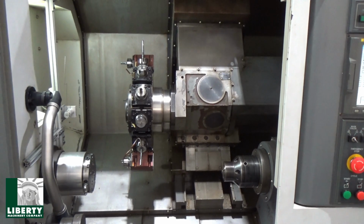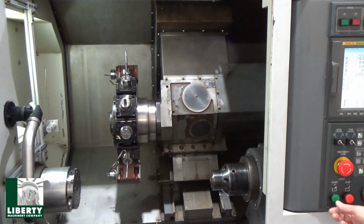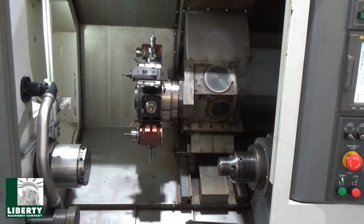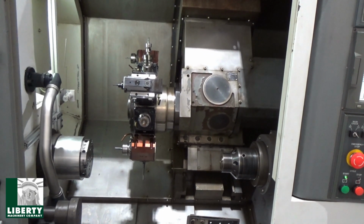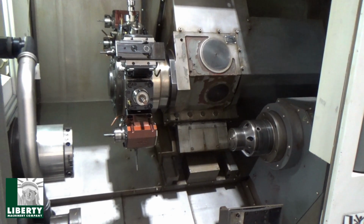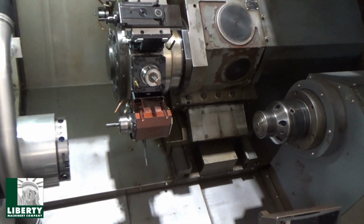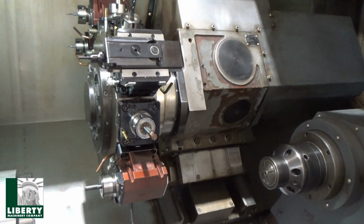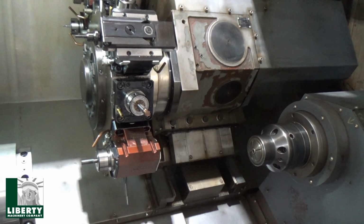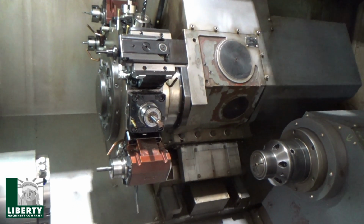And we're at full speed. We can be because we're cutting air. Spindle doesn't matter. It's going to be a C-axis over there. We're at the beginning of the program. I should be able to go right now. Let's see what we get. We're doing a pattern of sorts, utilizing that Y-axis for geometric design. Rotated C.